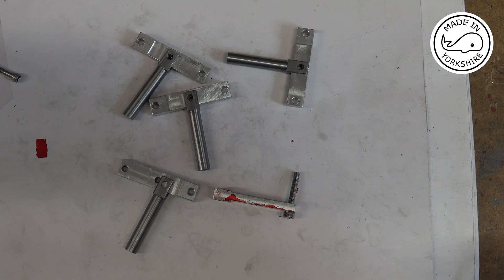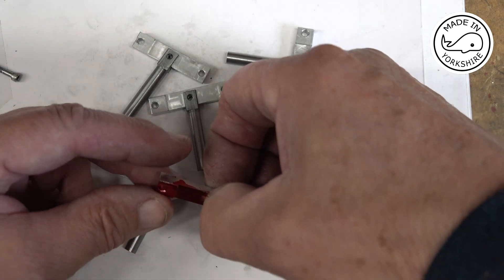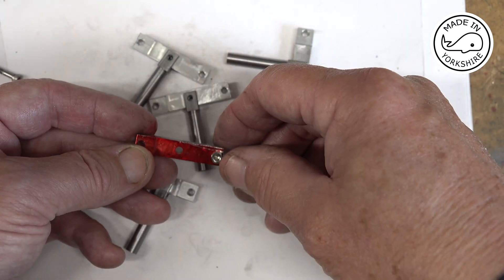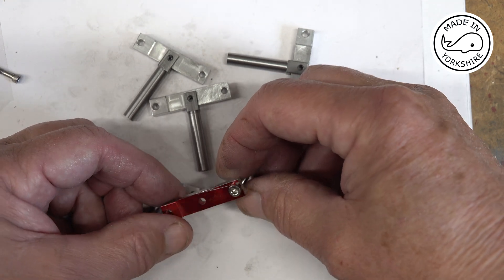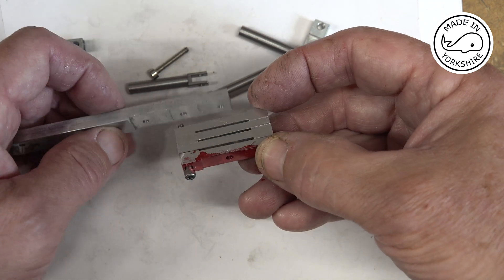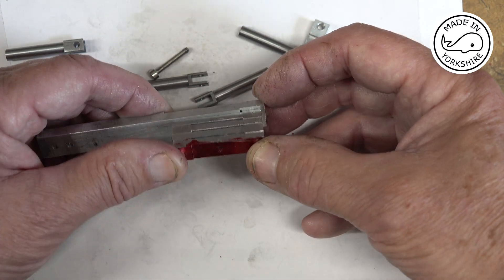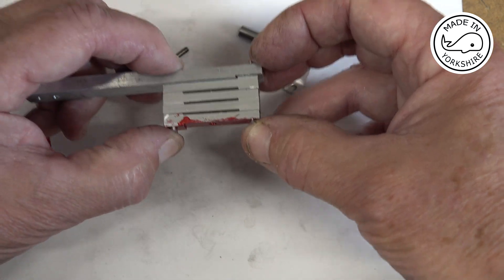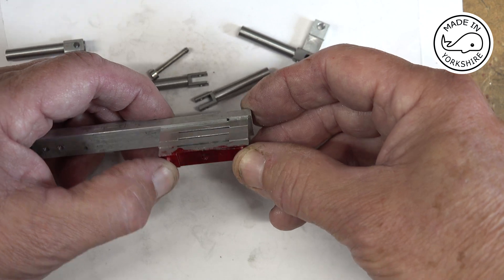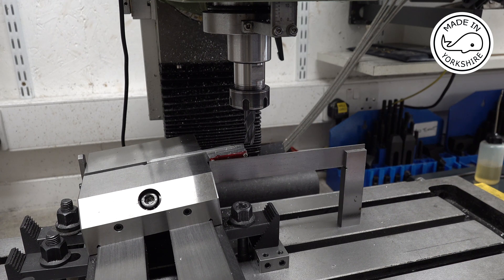I decided to make five rocker arms this time round so we've got a spare one just in case I goof up again. What I need to do now is cut some light tapers on each of the corners. I've stacked these together, and if I put them on here I can bolt them down and put them in the mill to mill the angle. I've got four of them on here — unfortunately I've not got bolts long enough to take five, but that's the plan. I've worked out from the drawing that the angle of this taper is 5.33 degrees, and with that in mind I've worked out that this end of the vice needs to be raised by 0.439 of an inch.